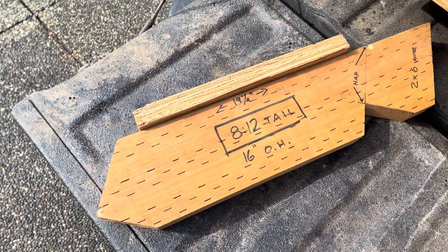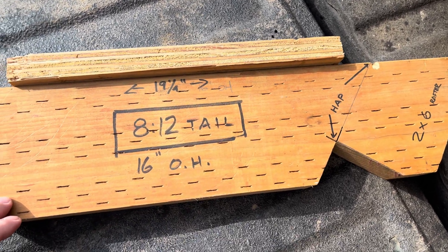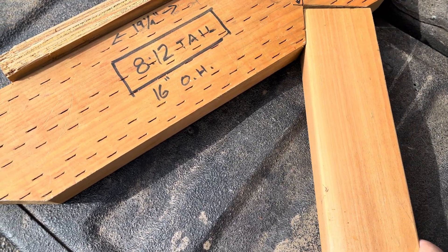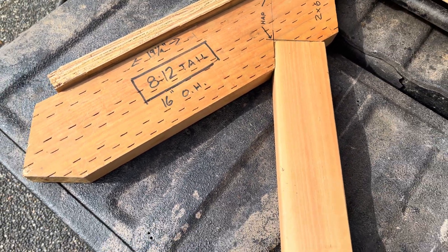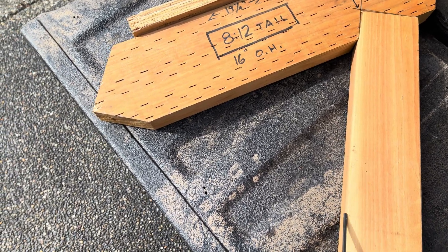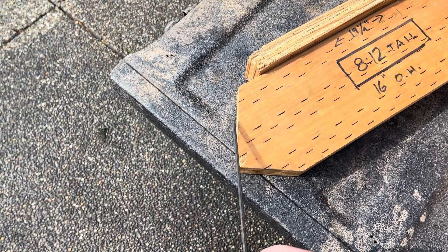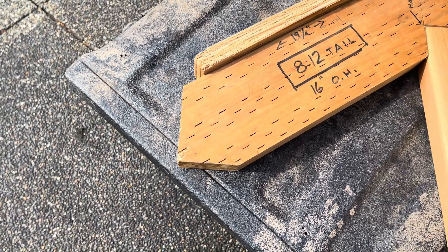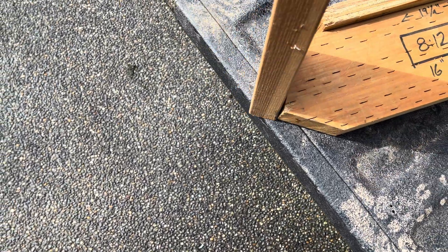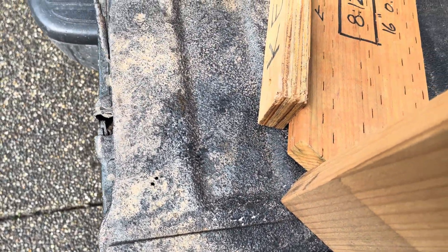That's the real philosophy. The tail is what covers your overhang. If that's the outside of the framed wall and then you have sheeting along here, this is the overhang off of the house. The overhang goes to the outside of the sub-framing over here. We're going to use this block a lot, and you're going to nail it — there are a couple things to consider. You're going to be flush.